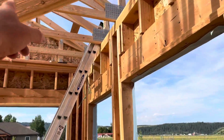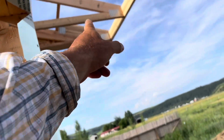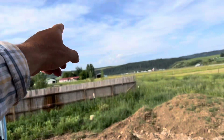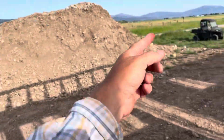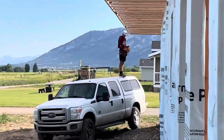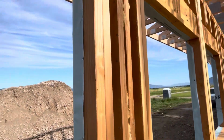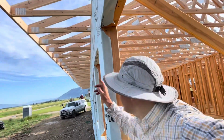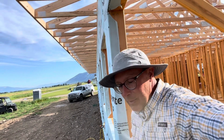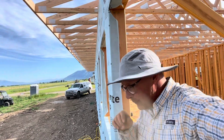I climbed up here. We used the truck to and I nailed in the chalk line 4 feet up. And then Matt climbed up on the truck, got the long 150-foot chalk line. He took it down there, and Greg had climbed up in. And then we lifted it up and over and laid it and marked the 4-foot chalk line so we could get the first 4-foot strip in of sheeting. And then we'll just run off that. Work our way up.